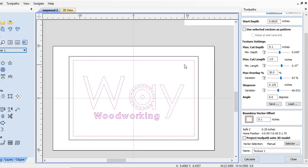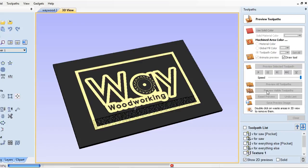In my case I'm using a quarter-inch ball nose. Here you can see that proper selection of your vectors is crucial for telling the toolpath where to cut and where not to. I'm wanting to leave the logo undisturbed, so I set a boundary offset with this setting here.